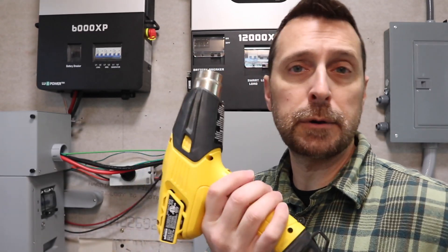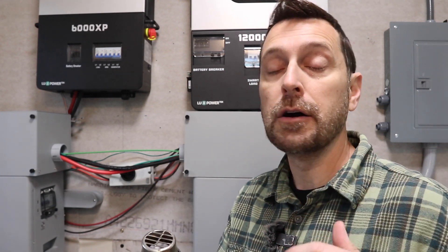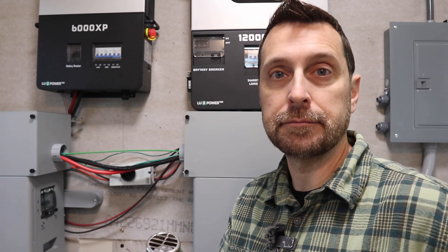If there is a big imbalance, I'm going to add in the ubiquitous heat gun to try and drive up one leg or the other, or try and surge it over its capacity. This is a great test for the inverter because the mini split heat function, which will be on today, is a better test than air conditioning — the heating draws more than the cooling. Let me show you what our baseline is, and then we'll start turning things on.